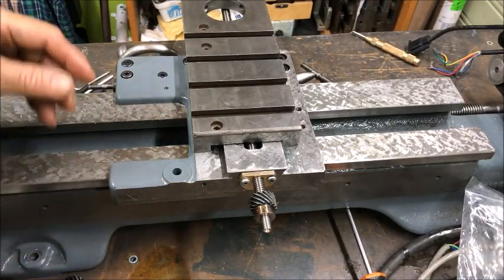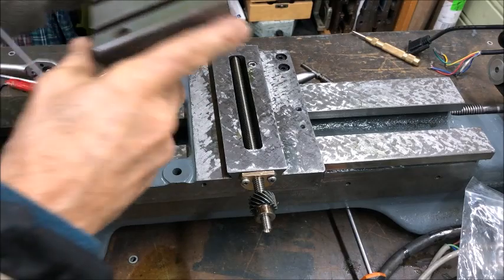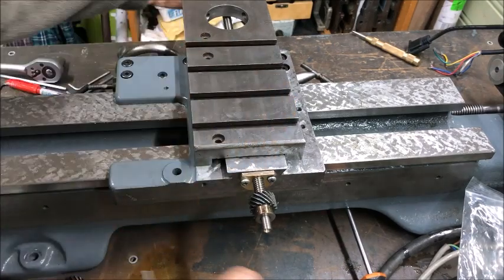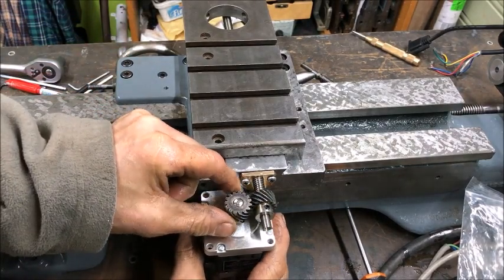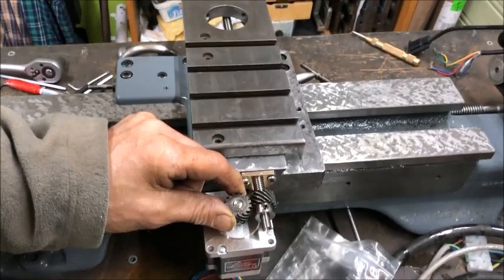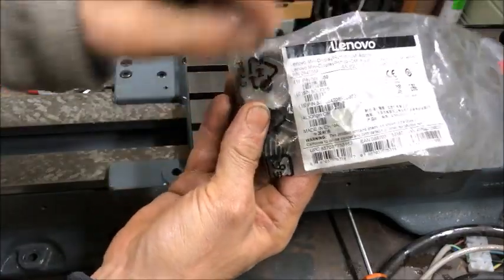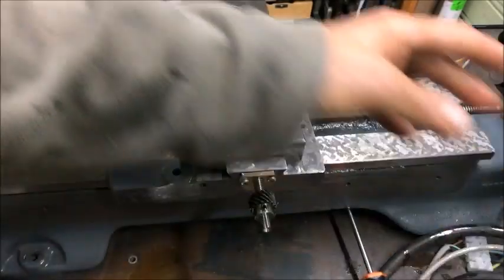I mounted the nut here at the rear as well, together with the one in front, so they are now a pair — just shimmed with some washers so this is snug. I've used this pair of gears that come in one-to-two pairs; I used two of them equally for the z-axis and these two for the x-axis.